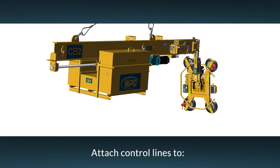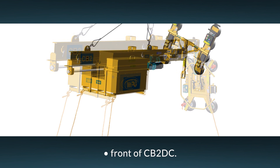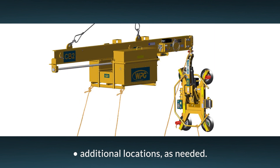The use of control lines is required for the best possible handling of the counterbalancer system. Attach control lines to both holes at the rear corners of the counterweight bins. To help control rotation and pitch, connect a third control line near the front of the counterbalancer. When operating a P2 lifter in an inverted configuration, the third control line should be connected at the lift point of the lifter. Contact Woods Power Grip about using newer P1 lifters for this as well. Use additional control lines as needed when the lifter and load are suspended from a shackle. Please note that the length of the control lines varies depending on the job requirements.